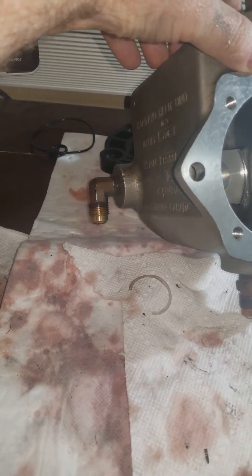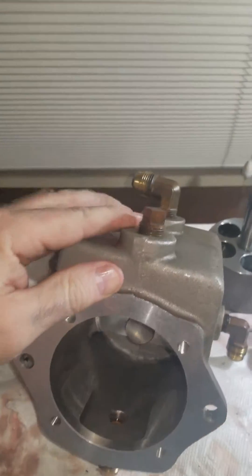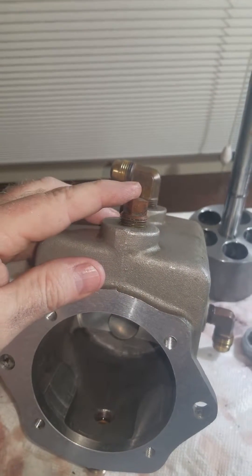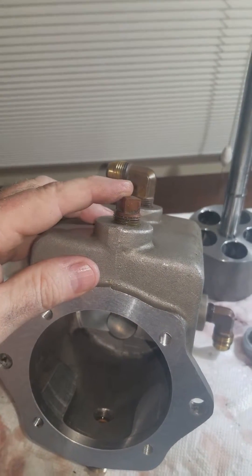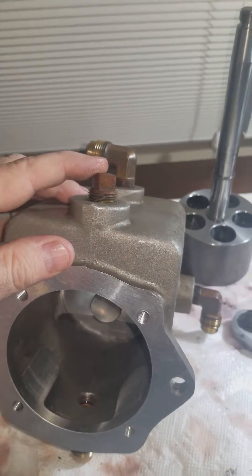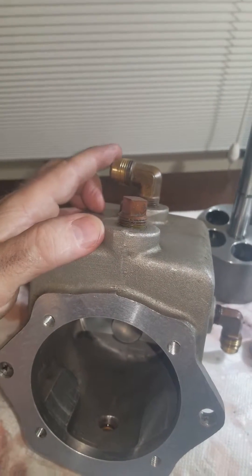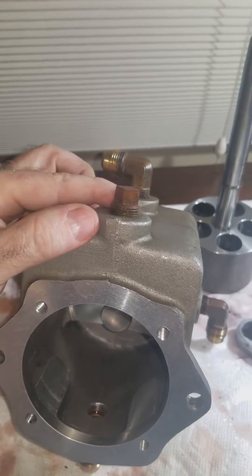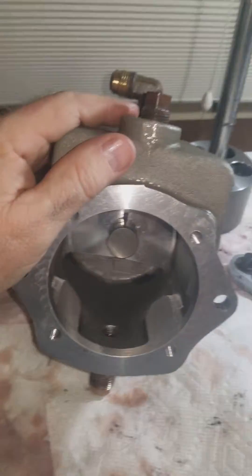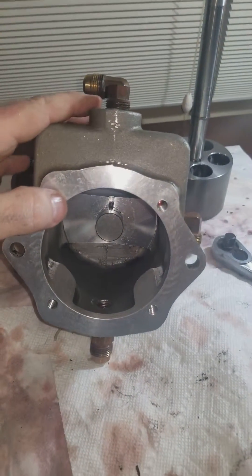On this side we have a port and a starboard. On top we have a fill plug which we won't be using once the fly bridge unit is hooked up — if you pulled it, you could potentially have oil coming out, because the oil from the fly bridge system would come in through here and literally pour out the top. That's why on my particular bridge it's very difficult to get this out. It's not intended to fill there.